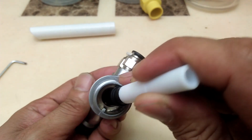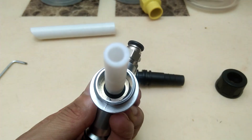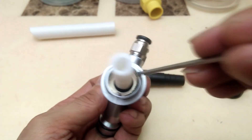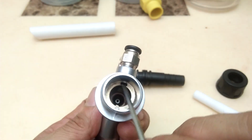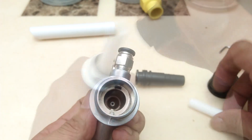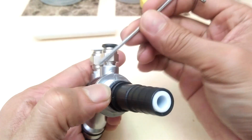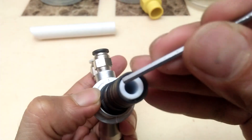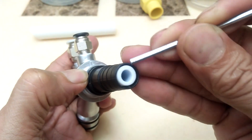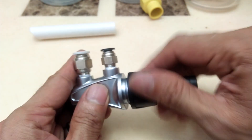The insert sleeve has an o-ring that seals off the chamber on the pump body connected to the conveying air input port. Another chamber connects to the supplementary air inlet through this hole. The hose connector is actually part of the chamber, and the supplementary air fills in the gap between the insert sleeve and the hose connector body, eventually going to the hose together with the air-powder mixture drawn out by the venturi.